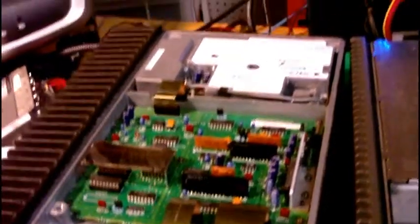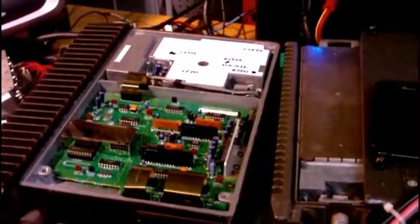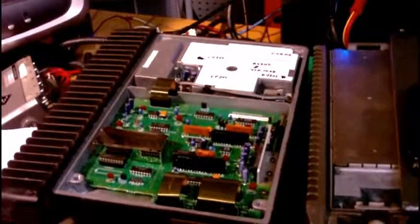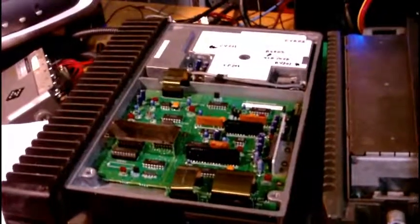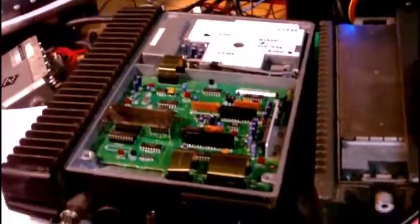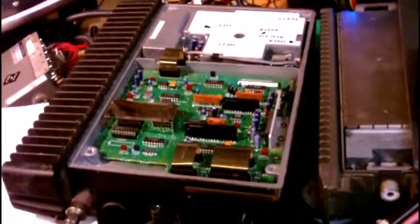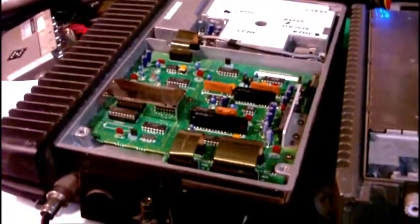Rangers and Deltas are also available in UHF if you want to get active on 440 — it's an inexpensive way to do that. There are a lot of these on the market right now, particularly the Rangers, because recently the commercial two-way radio band has gone from wideband to narrowband — most of the commercial world is now on two-and-a-half kilohertz deviation. So there's a lot of equipment like this that's just going to be junked, sent to the scrapper and melted down. See what you can do to save these radios — they're worth saving.